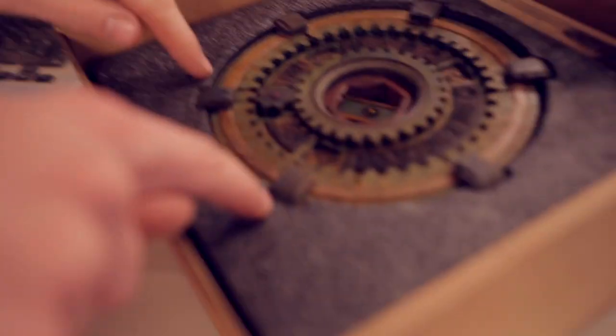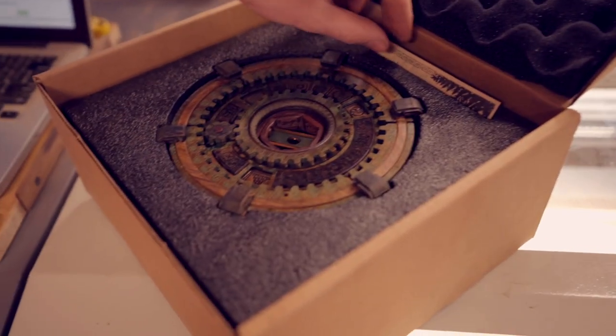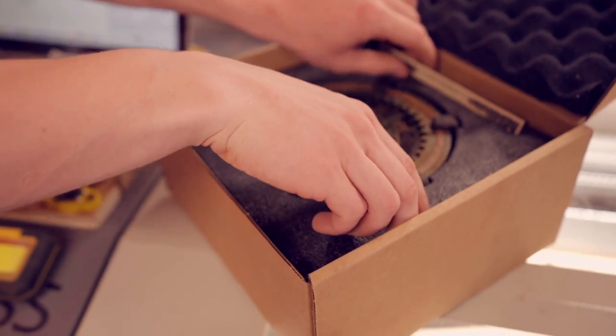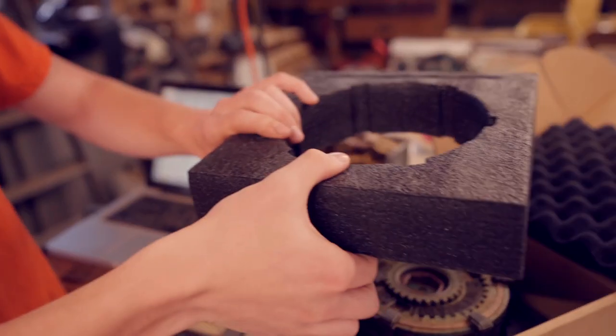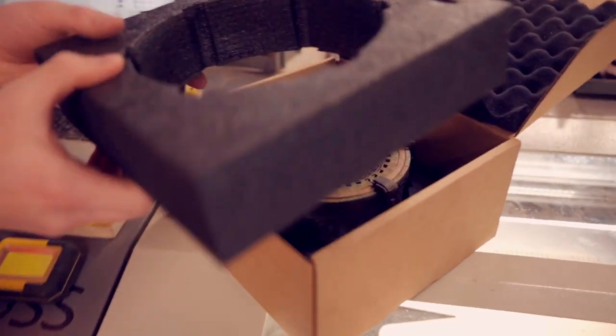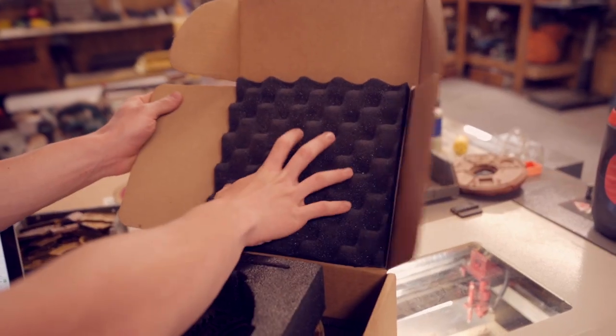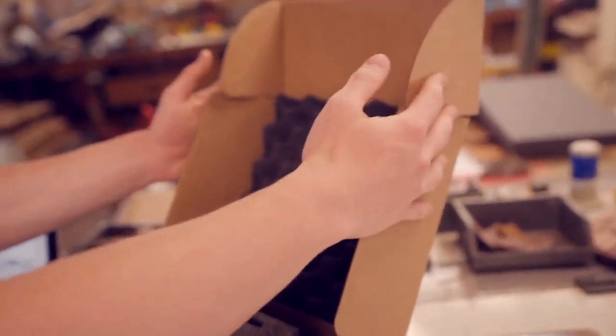Why does it take so long? The foam is like two inches thick, so the laser has to go really slow. When it's going that slow it takes like 20 minutes just to cut one piece for one box. The laser cuts the foam to the contour of the box — it has a kind of contour slot right there. You can see, if you pull this up, that's how thick it is. There are two of these in there, so it takes 20 minutes just to cut those two. We also cut this top piece — the egg foam — to the contour of the box so it fits all nice and snug.